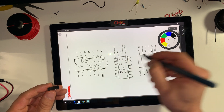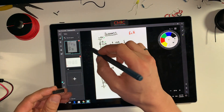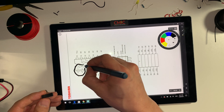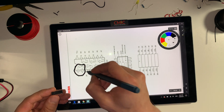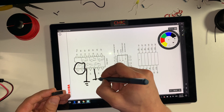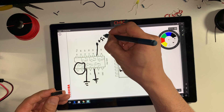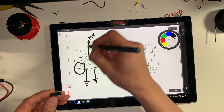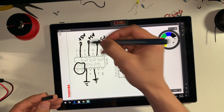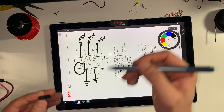For this schematic, you'll see it says U1A — so technically this U1A is the one right here that we will be using. Every other unused input should be connected to ground or connected to VCC, just to make sure the unused pins are tied to either VCC or ground. We're going to connect this side to positive 5 volts and then this side to ground, or you can just connect all of them to 5 volts or ground, whichever you want.